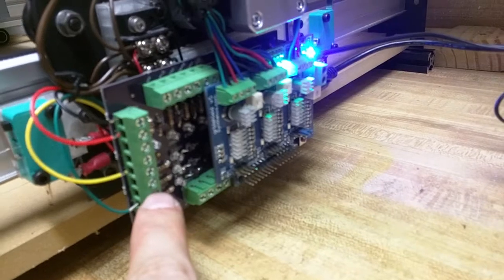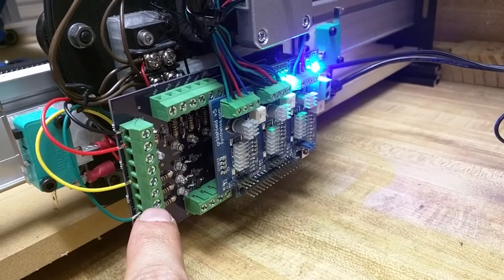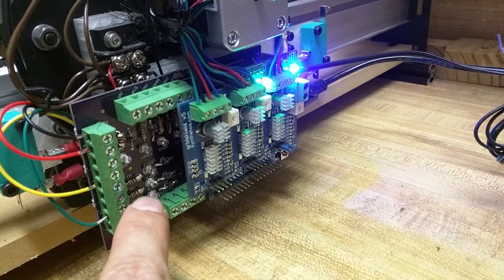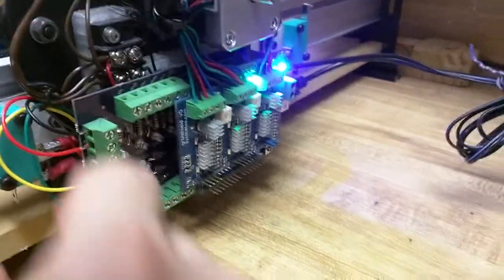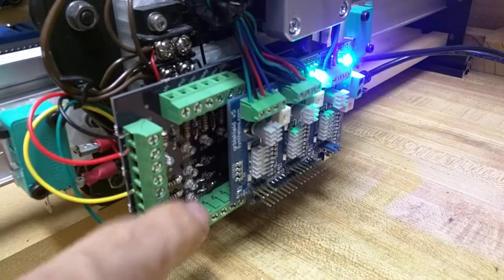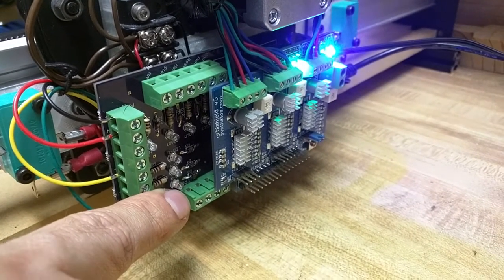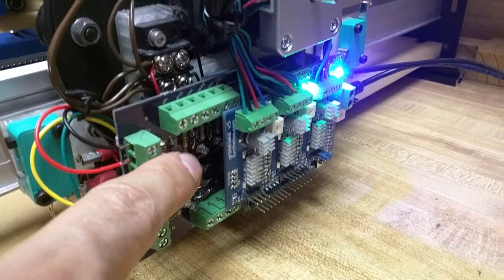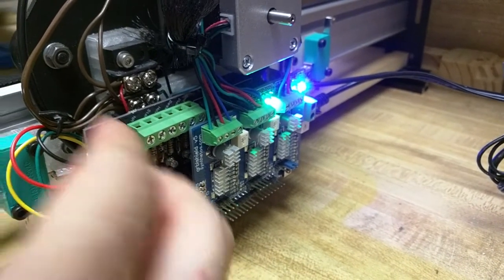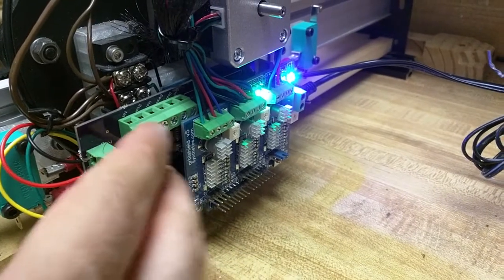You can see it right here. I talked with him in the forums and when he had some printed and populated, I bought one from him. It's a fantastic board — it's got all the connections for limit switches and it lights up when any of them are flipped. All of those inputs go through opto-isolators, which means that unless there's enough energy to turn on an LED, it won't get through to the Arduino. The other nice thing is that the input side from the switches uses the 24-volt power supply, so all that noise stays on the 24-volt line, and the Arduino's 5-volt line is on the other side of the opto-isolator, keeping that ground plane clean. This has been working really well.